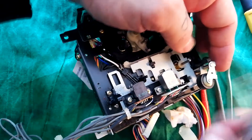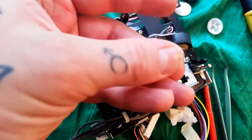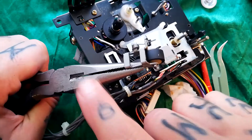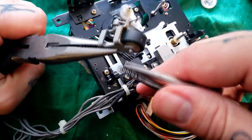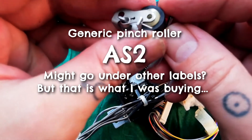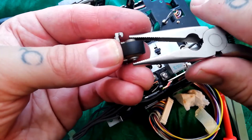I think I've accidentally taken that off — I'll need to watch back the footage to see exactly how I managed it. Since I've accidentally removed it anyway, I'll show you: you can push back and forth on the central pin — it's hurting my fingers because of all the sharp edges. Gripping it with needle-nose pliers, push it back and forth; when it's recessed enough, grab the central pin and pull it out. I'll put the part number on screen — they were plentiful and relatively cheap on eBay and Amazon. To replace, slide the new one most of the way in and click it shut.